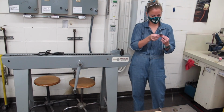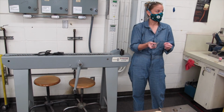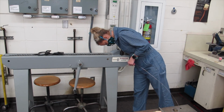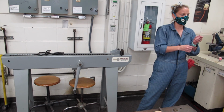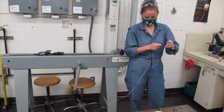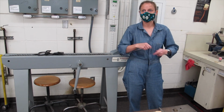So we started at 18 and I'm at 20. So I would anneal, because now it's nice and hard. And I was in the number 33, so I want to probably get to 34 or 35. And then I've got my 22-gauge wire. Okay? So I'll do the same thing to anneal, and then I could go again. But I just made 20 gauge out of the 18. Cool?